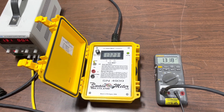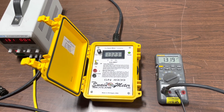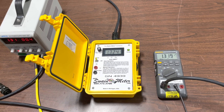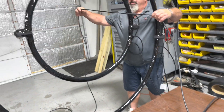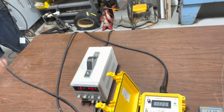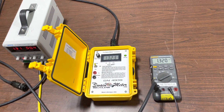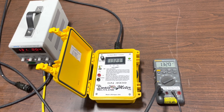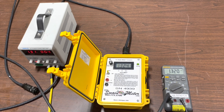While focusing on the value of the Swain Meter, I am going to move the 18 gauge cable around in the ID of this clamp. So as I am moving this around in the ID of the clamp, I am just going to keep circling this around and note the minimal change on the Swain Meter.